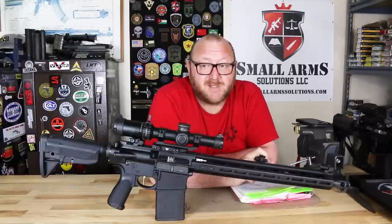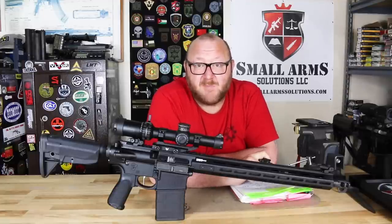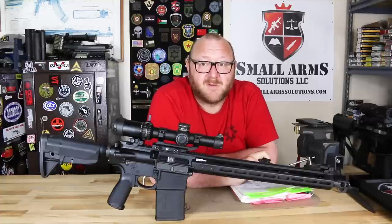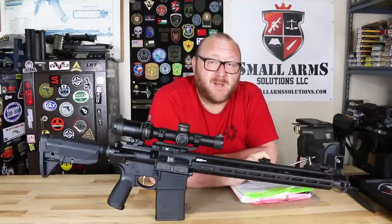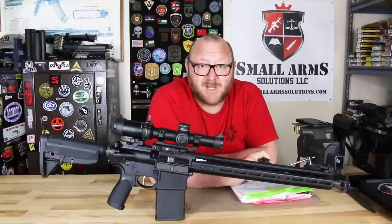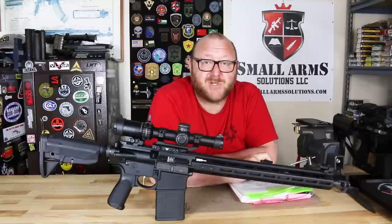And I will still say to this day, during the SAS program, when the final two were down between Knights and JP Enterprises, what cost JP Enterprises that entire contract was the fact that they didn't drill and pin their gas block. And when they did the endurance testing on the rifle, that gas block moved forward, causing the gun to short stroke, and that was it. The gun failed, and Knights won the contract. So nobody's going to tell me that it doesn't happen. It does happen, and it's affected a major U.S. government contract because a company didn't do it.